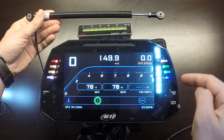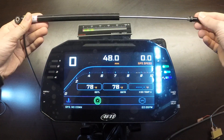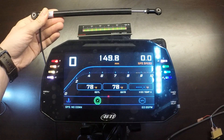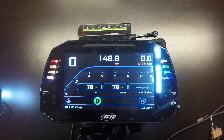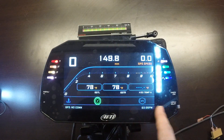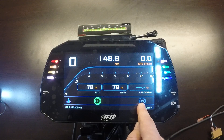This is optional; however, we can configure the RGB LEDs to simulate a similar effect. Whereas the engine trims in and out, we can use these as indicators for a quick visual reference of where the trim is actually positioned. We can also freely configure some of the icons on the bottom of the screen. Currently we're inside and do not have GPS reception — we're below the number of satellites required for a full GPS lock, so it's showing the GPS icon.